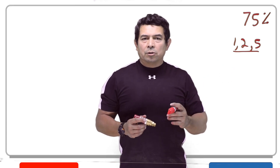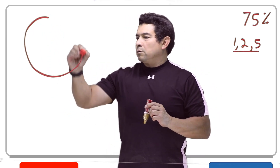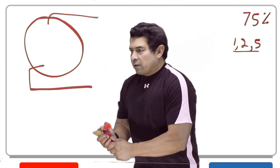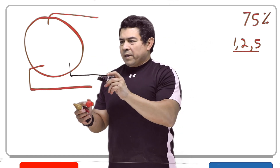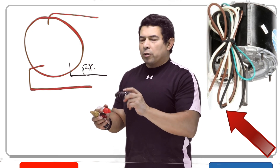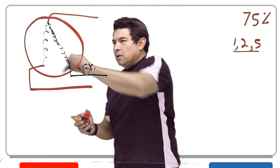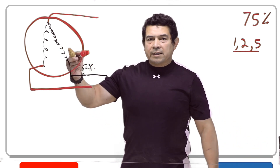As we said in a previous video, you're going to have your motor with wires coming out — and this one here, typically, is going to be your brown wire, and that's going to be for your start winding. You're going to have your start winding and then you have your run winding. One of the ways that you know which one is which is because the start winding has higher resistance.